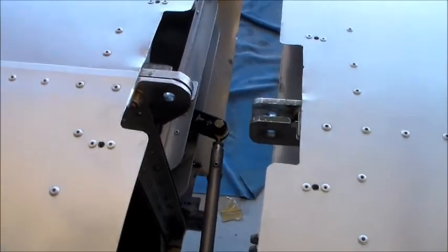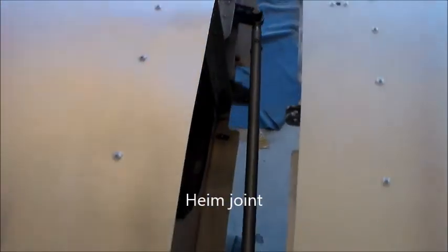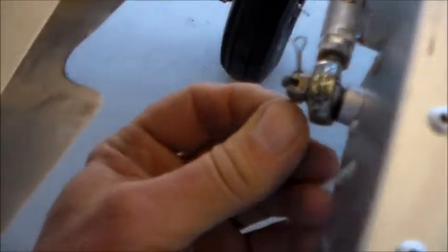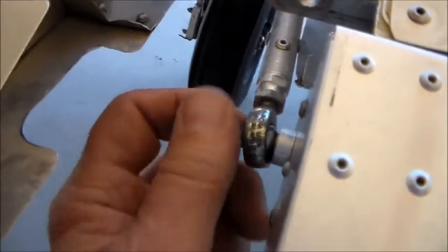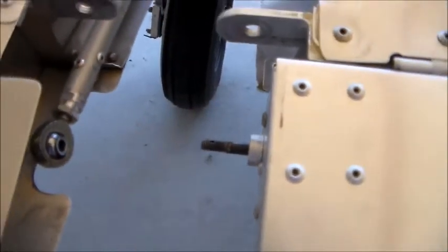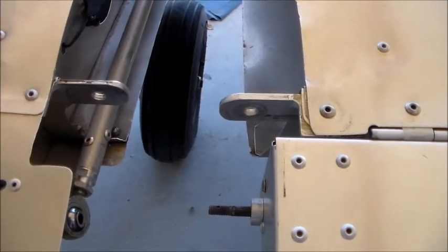Here you can see the aileron control rod going up to the bell crank. The stick has another control rod that mates to the other end of that bell crank, and when you move it you're actually moving the ailerons. It's secured with just a cotter pin and a castellated nut that's finger tight because the cotter pin is holding it. That's what makes the ailerons move up and down — gives you a very positive feel and makes the airplane extremely responsive when you're flying it. The wing is now free, and I can use those webbing straps to put it into the cradle.